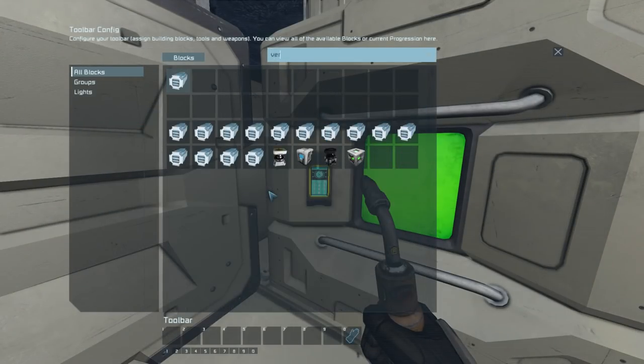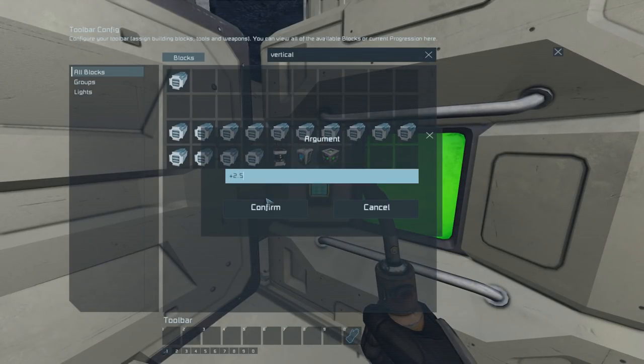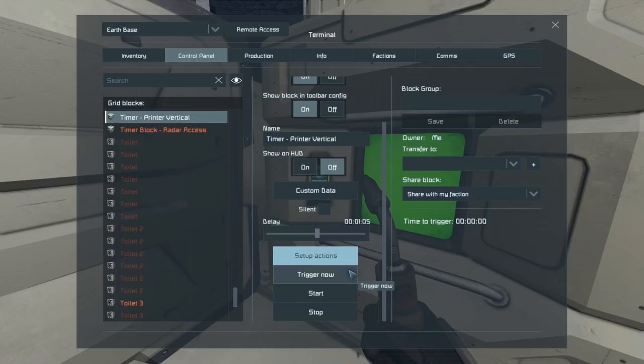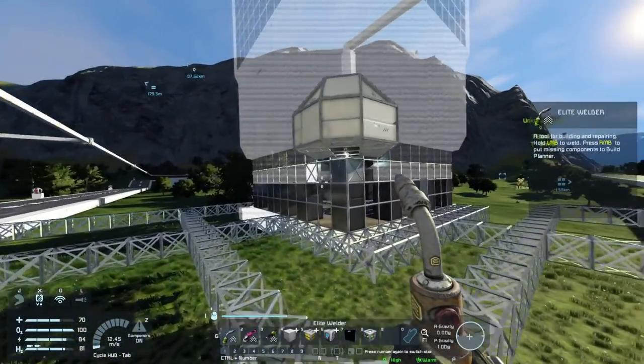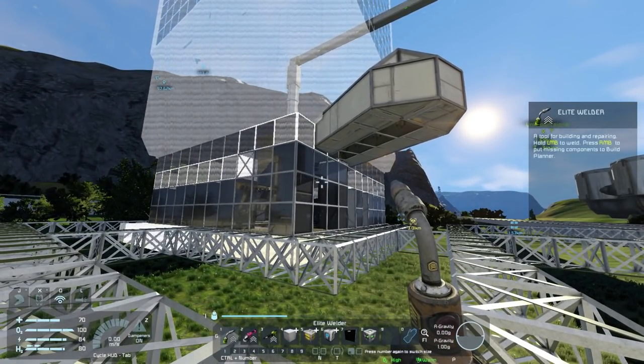Timer: Printer Vertical - going in every 65 seconds. We'll set up our actions which will be the vertical to run with plus 2.5. We need it to call itself so it repeats. Start. Then we'll just hit 'Trigger Now' because we already know we're done this level. So it's going to raise up 2.5. There's no issues with things getting built up prior to the weld head getting there because we have the buffers on each side of the welders.